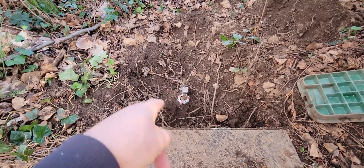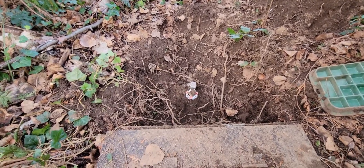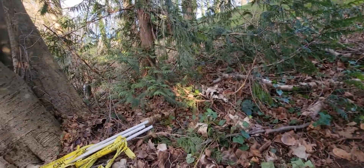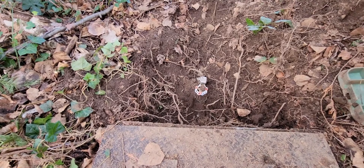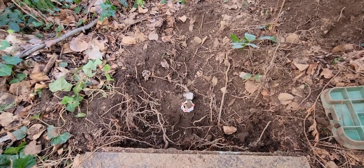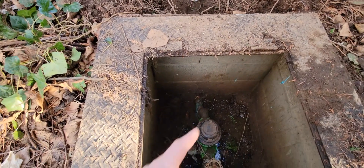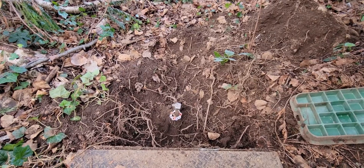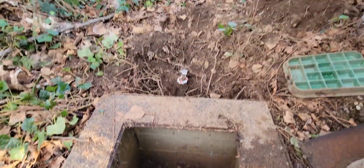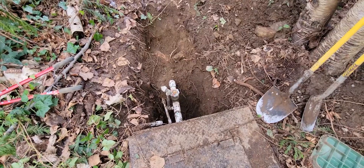The flow sensor needs to be about three feet plus from the master valve. So I'm going to need to dig a trench, and there's root-filled ground — trees everywhere. I have to go about five feet up and three feet wide and three feet deep to get down to it. It's not going to be fun, so I better get started.